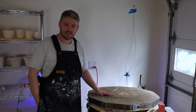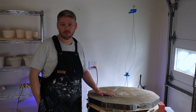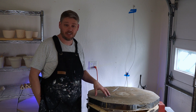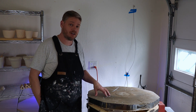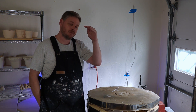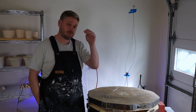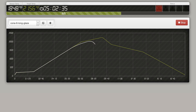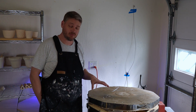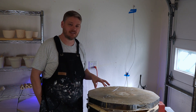I got the new daughter board installed on my kiln — it was putting up a good fight, requiring both hardware and software changes to get working, but the new temperature sensor is working. I got my kiln fired again and it was climbing past where it stopped before. However, I still have a problem: the elements were full on and the temperature was rising but not keeping up. Eventually the program changed, it caught up a little bit, then fell back behind and the temperature started decreasing. Here's a screenshot from the software showing that happening. So I think that means the elements are no good.